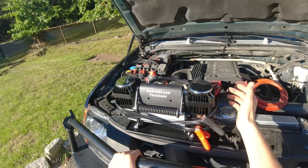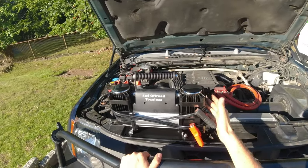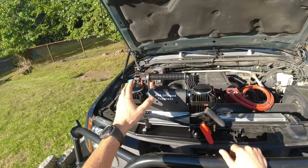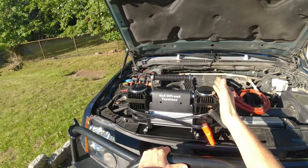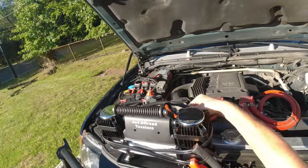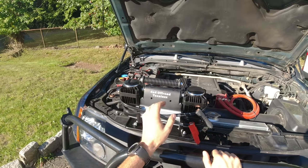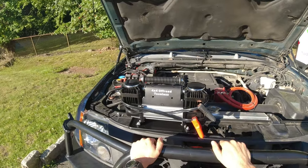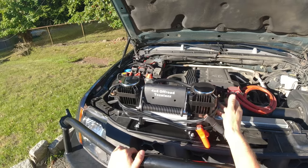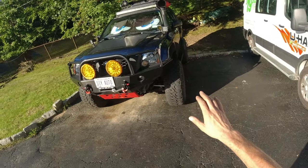Hopefully it's gonna work for a long time, but you never know — sometimes even top brands can fail. By no means is this a bad air compressor; it does the job, it fills up air much faster than a single cylinder, which took about 2 minutes and 30 seconds, whereas this one took about 2 minutes. Maybe if I get better at it, or even if you replace the hose with a bigger gauge hose, that would deliver more airflow where the current hose is kind of restricted. You be the judge — the top brands cost over $600, this one is about $200. They both work.